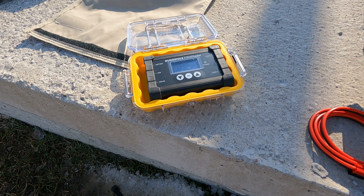We're doing battery management for high voltage and low voltage. If the battery voltage drops too low, it'll shut off and protect your radio. If you get an overcharge, it can also shut off power to your radio — so there's protection there. The power monitoring device gives you the charging voltage and the different voltage levels. And you also have power distribution built in.